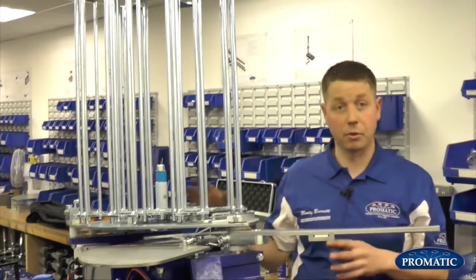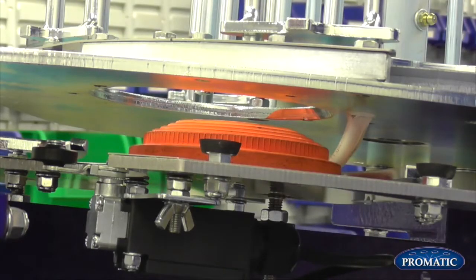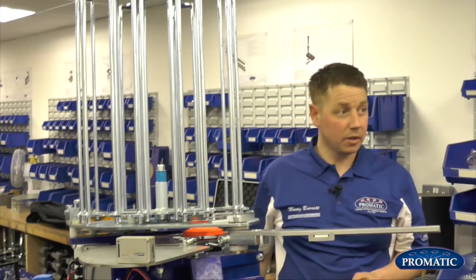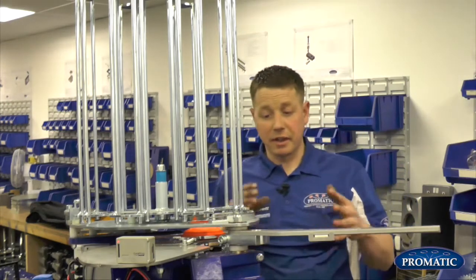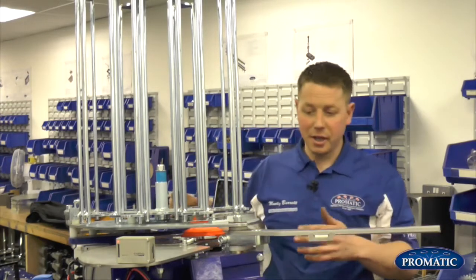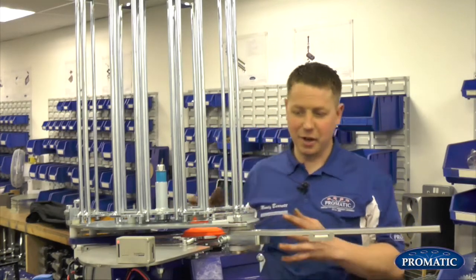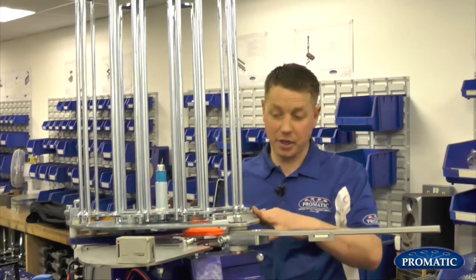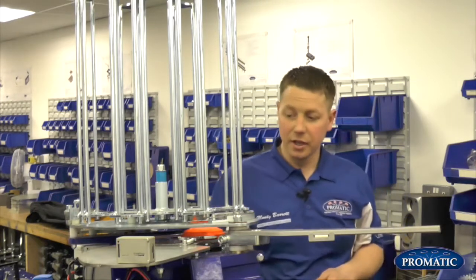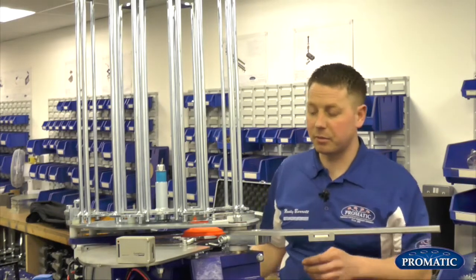we should be good to go to come on to putting the spring back on, now that we've finished going through the machine. So one of the keys about the Promatic trap here is everything is designed to make sure that the clay has a perfect flight, but is also going to limit the amount of no birds each time. When you think of the lifestyle of a clay, from when it's actually made to its journey to a clay pigeon trap, it goes a long road, sometimes goes overseas, and then it gets put on the back of a quad or the back of a trailer. So we're trying to give the clay the best possible chance to come out of the machine in one whole piece. By adding all these little things, like putting the soft fall plate on and your spring finger, they will all help the clay before it actually gets thrown out of the machine.